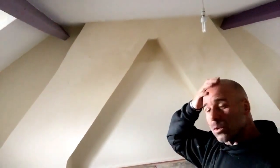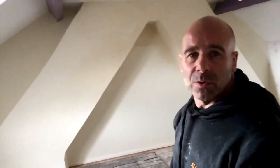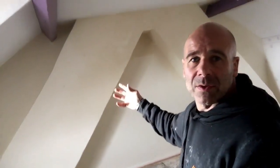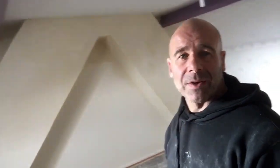Alright, and we go up into the attic, which will keep us fit. My knees are going. Right, look at this chimney. So that's as bad as it gets. Basically, soot from the chimney flues inside, for 110 years, fossil fuels burnt on fires downstairs. Inside of there will be lined with soot, and that's got sulfates in it, it's carbon. And when they've got wet, because they're not vented, then the sulfates migrate to the surface, which is unfortunate.